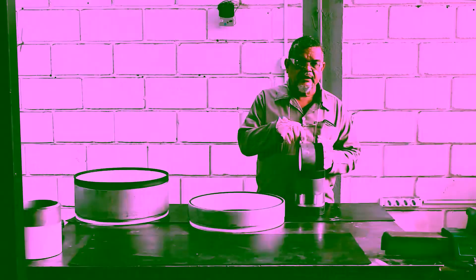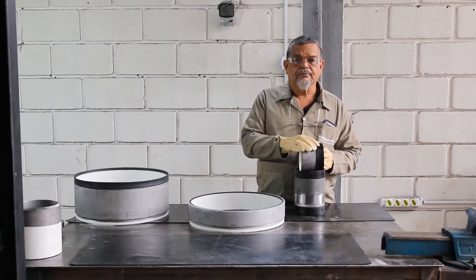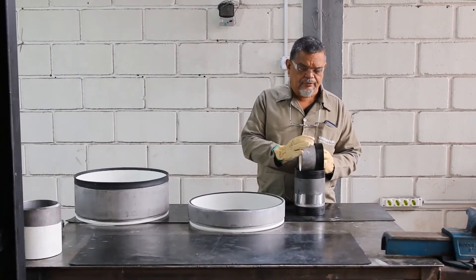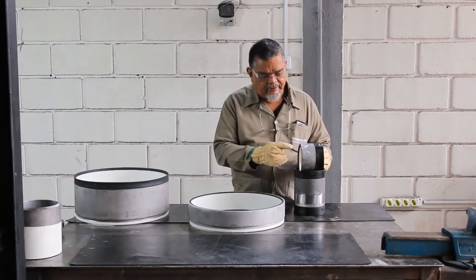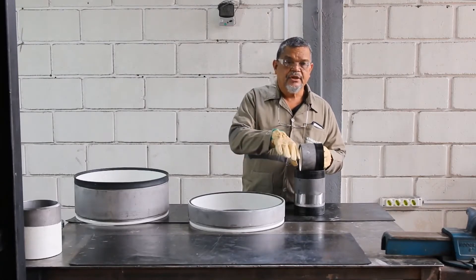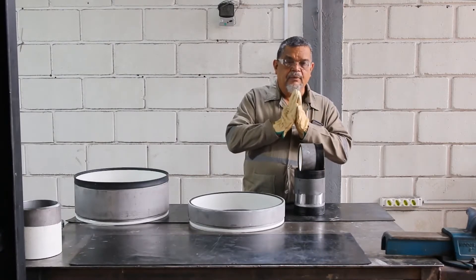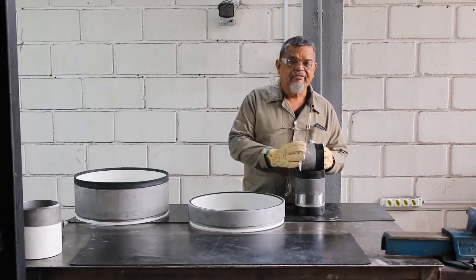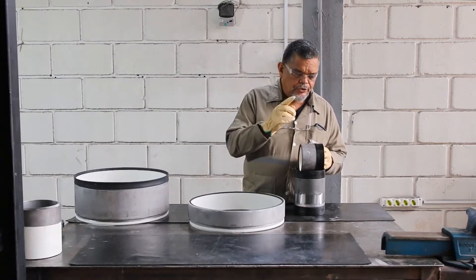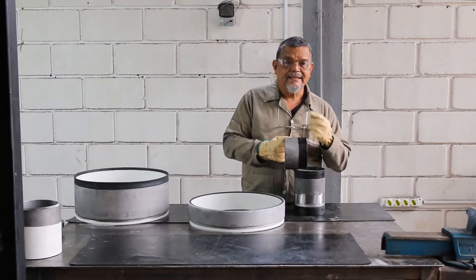The ring has an integrated insulation layer that is asbestos-free and completely isolated from the flow of the fluid that comes through the pipe. We have a sealing system on the face of the ring where it matches a similar ring on the next pipe to be welded. These two gaskets, compressed against each other, effectively seal the possibility of leaking fluid into the weld zone. We also have a bore seal, which seals the ring against the liner of the pipe.